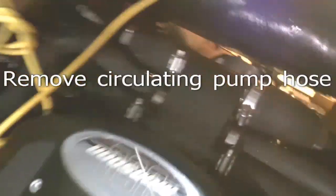Now we're going to drain the hose on the other side of the seawater pump. Lay it down — it's pretty well drained due to the hose actually going back to the transmission cooler that we already drained, so it's pretty well empty. Now we're going to drain the J hose, which is the larger one out of this cluster of hoses right here. It goes around to the raw water pump. I've already got the worm clamp off — now draining the J hose.